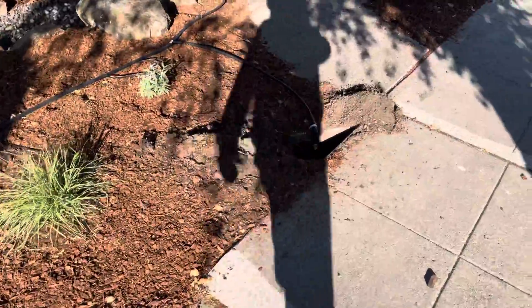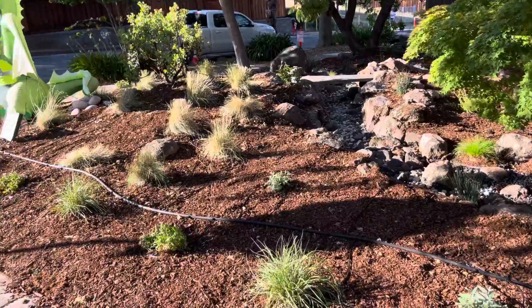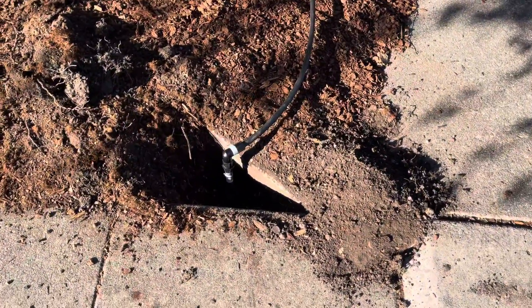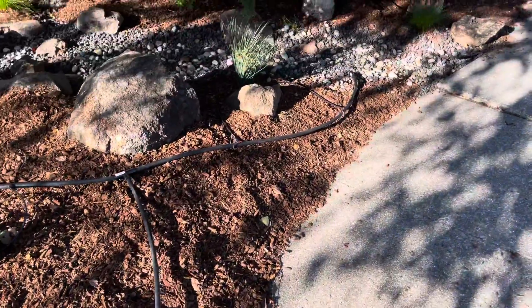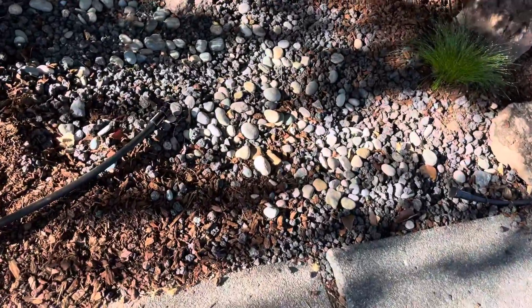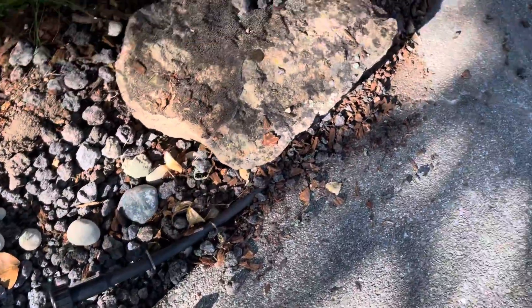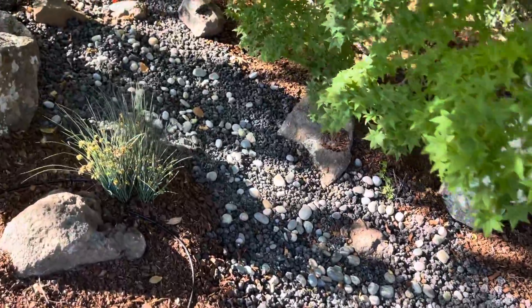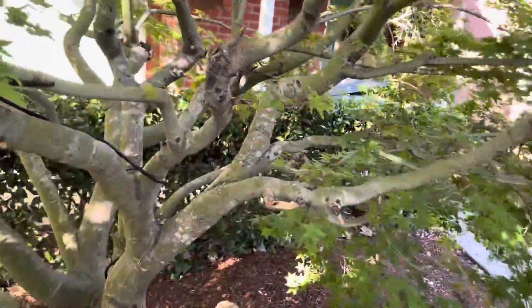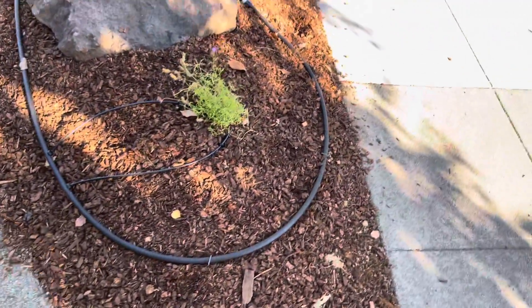This dragon side garden meadow and manzanita is getting fed from this riser that used to be a sprinkler. Again, we have flush caps that will get buried, but you can always uncap them to flush the system and also water down the stream. We also have an emitter coming up here sitting above the birdbath, so when the system runs, fresh water goes into the birdbath.